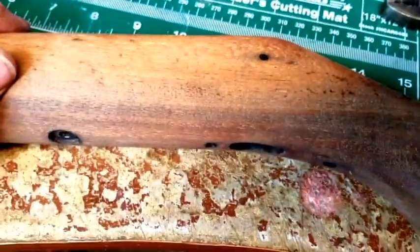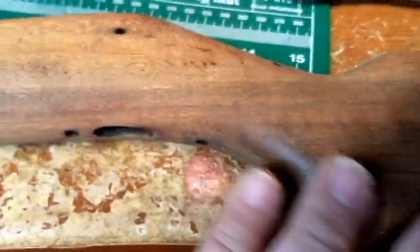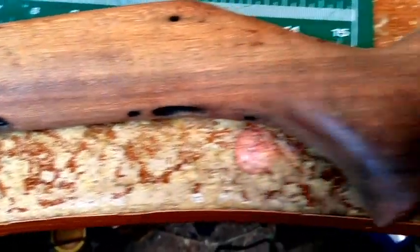There's lots of guys out there that have already done videos on why you steam, but basically it's so you can open up the pores and raise up the surface of the wood. That's also called whiskering the wood because these little fine fibers will come up and you can feel them if you run your fingers across it. Then you go over that with some fine sandpaper or steel wool to cut that back down. It just makes it so that the wood will take stain or whatever finish you're going to put on it that much better — it'll soak right into the pores of the wood, especially if you have a dense wood like walnut. I'm going to let this dry out a little bit more before I start fixing those dings.